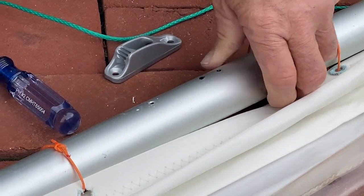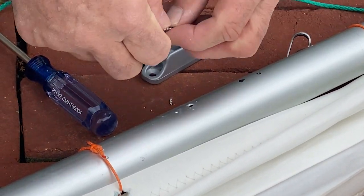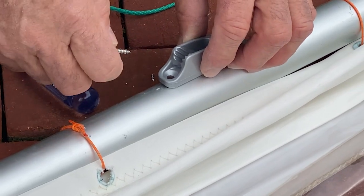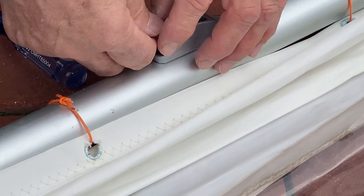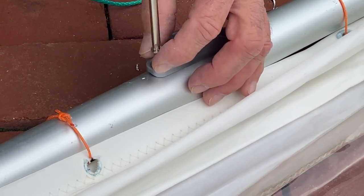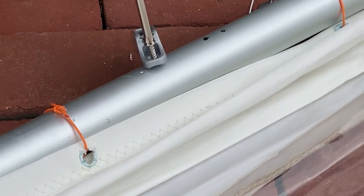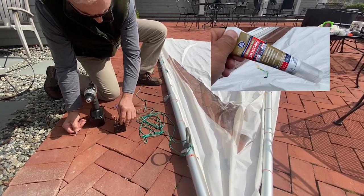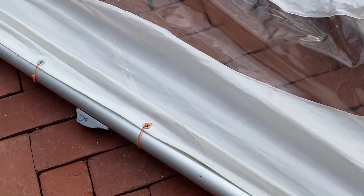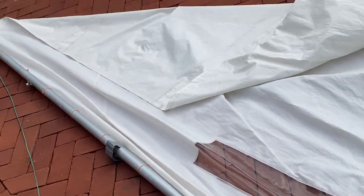Let's see how that goes. It's always better to do it a little slower. It might be tight but that's okay — tighter is better. We're just doing this for demonstration purposes without silicone yet. Once you have the cleats drilled, you can put silicone where the rivets or screws will be, silicone the cleats, and attach them down.